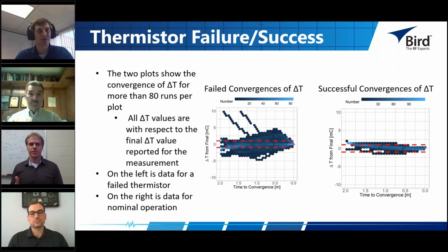You could probably take a shorter calorimetric measurement. I mean, you could, but the accuracy would be a lot worse. Your repeatability would go way down, and you would lose confidence in your ability to make measurements. It's like, again, your type 4 bridge thermistor mount. That's why it takes several seconds. There's actually some circuitry in there that needs to equilibrate before it can make the measurement. And that's why that takes like 10 seconds. And your terminating power sensors, they are just snapshots because they are just trying to get the quickest measurement possible.